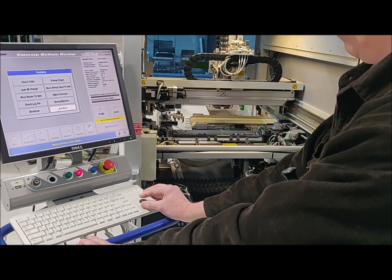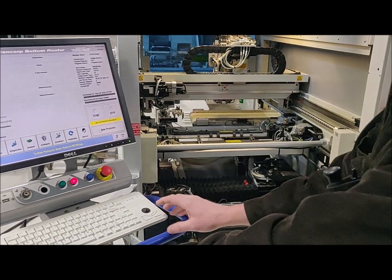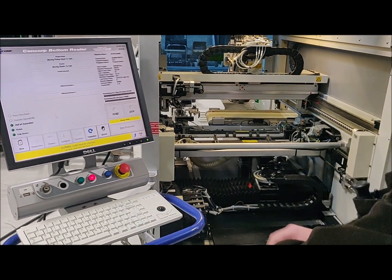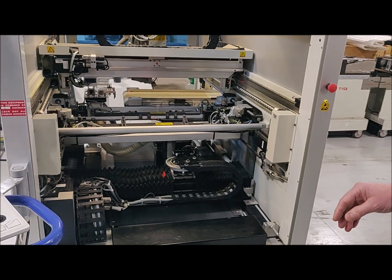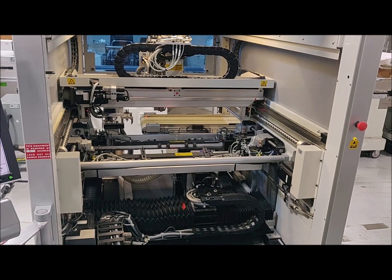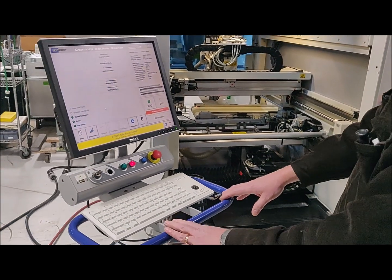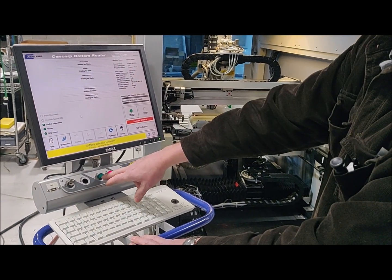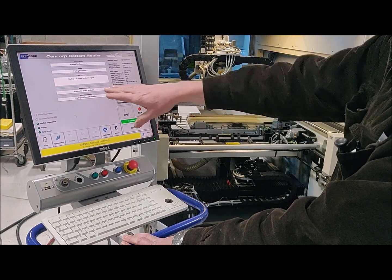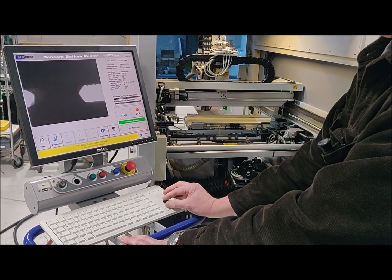We're going to run a board that was already programmed in the machine. The original owner had some boards for us, and that's what we're going to run — we're going to enter production. When it starts production you're going to see all of the belts turn; both offload conveyors are running. Production stopped momentarily — we're going to press start using this button to enter production. You can see it's waiting for a board available; the panel is waiting for a board. We're going to switch to the view so you can see the vision system working.